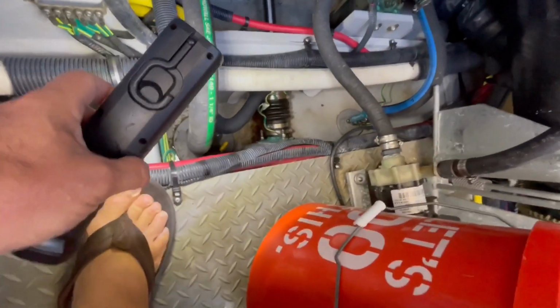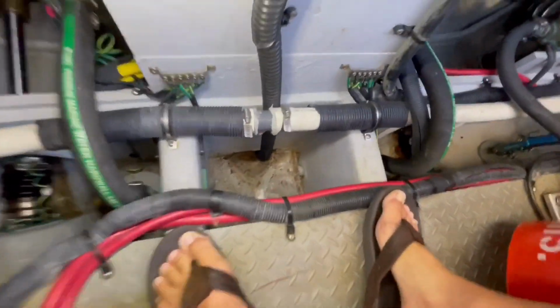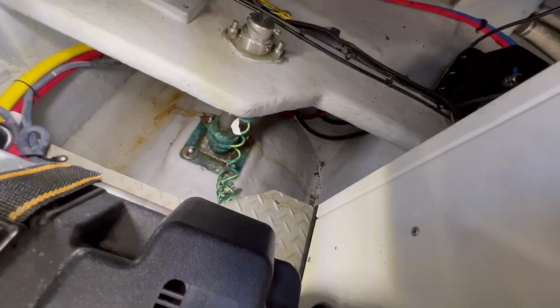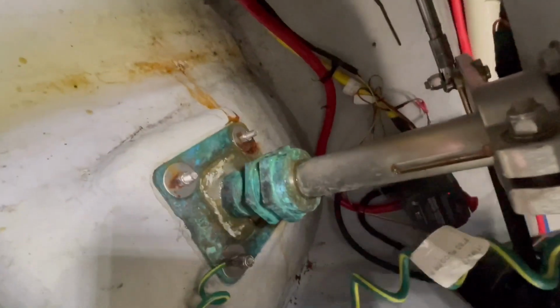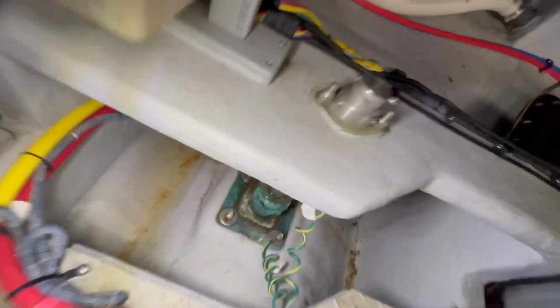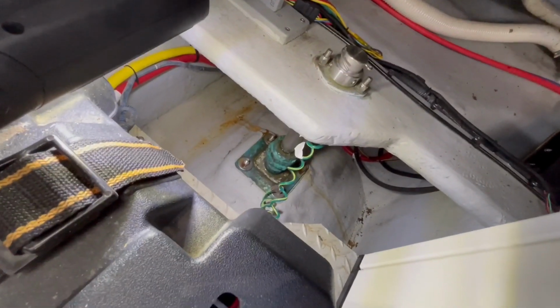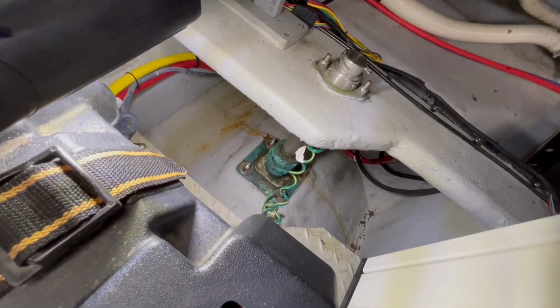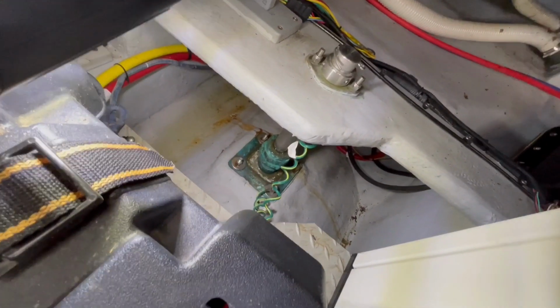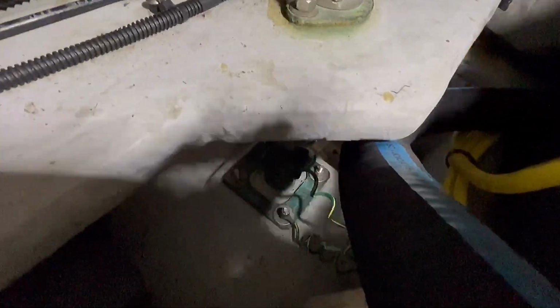That shaft looks dry. Seems to be a little bit of water underneath that dripless shaft seal. Nothing in the middle of the bilge. This rudder has been dripping slowly. I don't know if it's still dripping, but it's really not accumulating much water. That always had a little bit of water around the shaft. May just have to tighten up the packing nut or replace the packing, but that's going to all get checked out when we come out of the water eventually. The other one looks good.